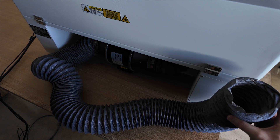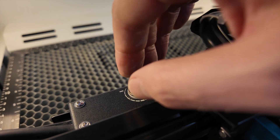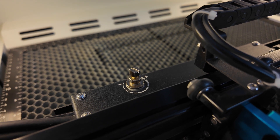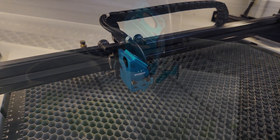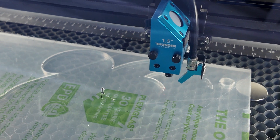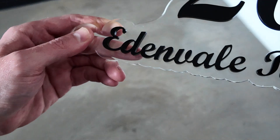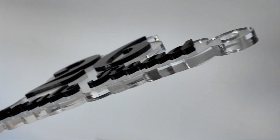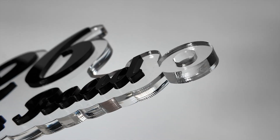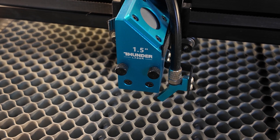This is the piping — the only external piping. There's no water chiller, no external air assist, which is a great feature and keeps everything nice and compact. This is the air assist control — that controls the amount of airflow from the air assist. Thunder Laser has built the air assist on the side of the laser head, which allows you to cut acrylic and get a nice polished look and feel on the edge. Whereas if the air assist was blowing through the laser head, you'd get more of a smudge mark. The Thunderbolt is also fitted with a 1.5 inch focus lens, which is great for engraving.